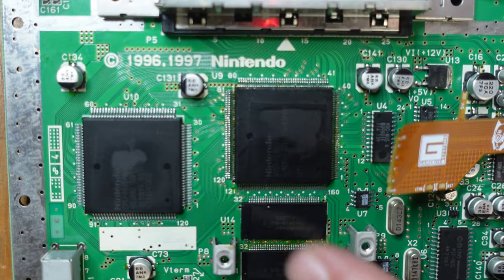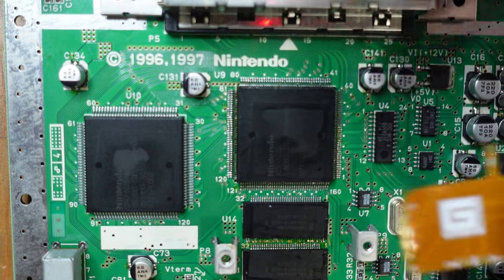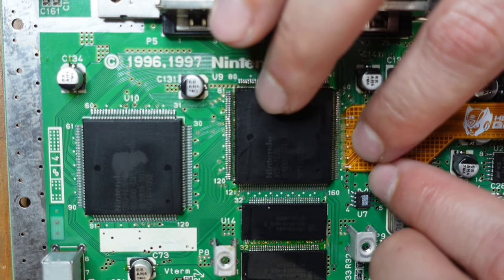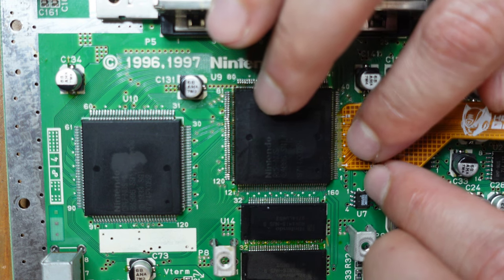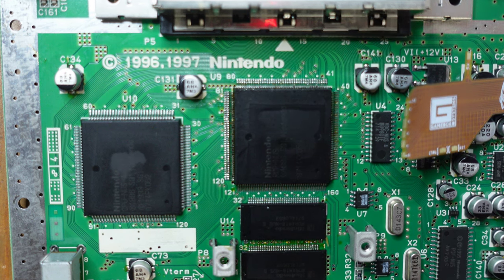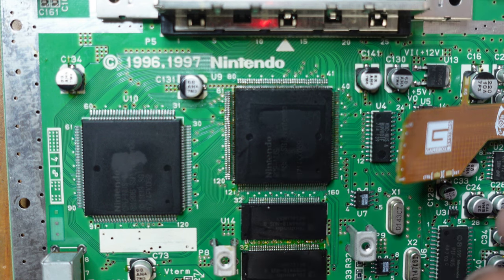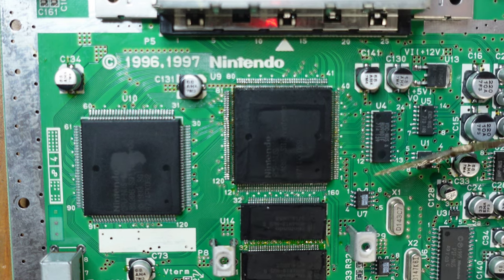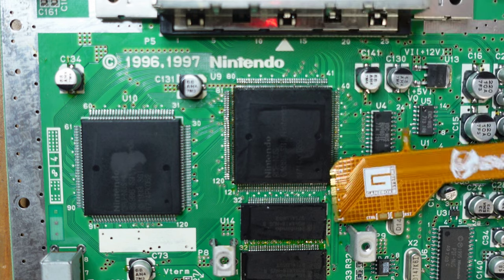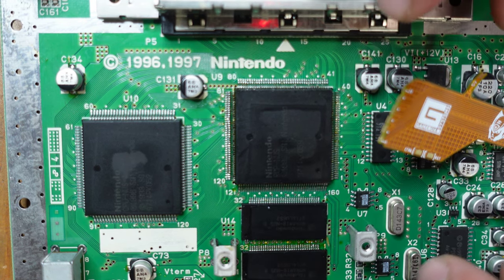The next step of this mod is to take the provided flex cable and install it to the RCP chip. This is a common feature for all of the HDMI mods and all of their flex cables bear a similar resemblance. So what we're going to be doing is starting at pin six, which is right over here. Normally what I'll do with flex cables like this is just use a very small amount of solder and tack it into place, and then combining that with some no-clean flux, I'll work each pad and make sure it's connected to each pin, trying to avoid making shorts if at all possible. If shorts happen, that's okay — we do have solder braid and we can wick away any extra solder and make sure there's no bridging of pins. Normally I do this under a microscope, but for the convenience of the video I'm going to do this by eye and then follow up later and confirm my work using the microscope.